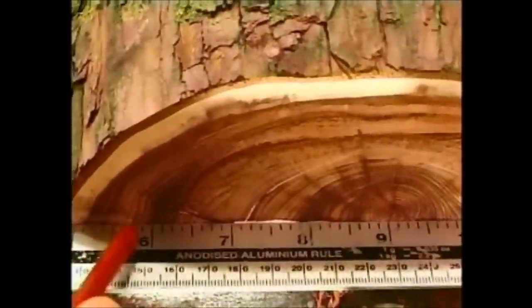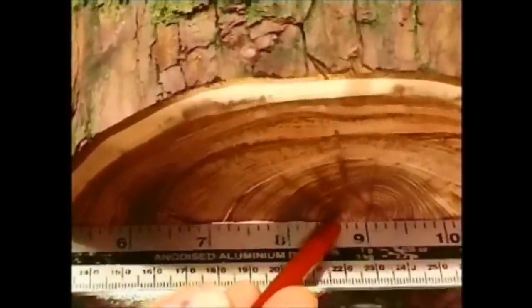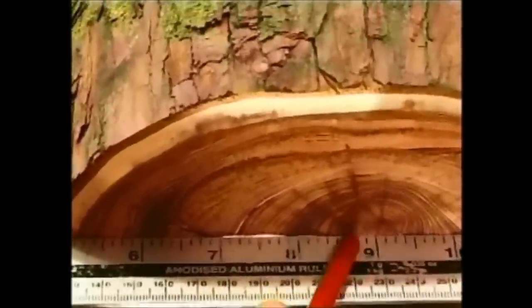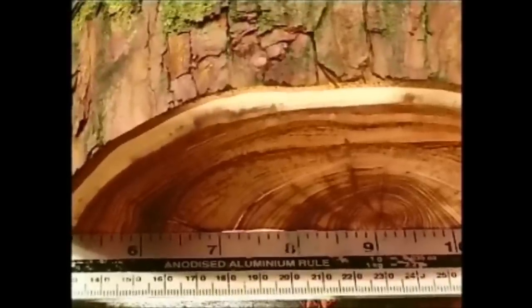Get this surface as flat as you can. Do not leave it bulgy, or the candlesticks will rock. Most people leave their bases concave to avoid the difficulty of cutting them flat. That will not work here. A hollowed base will leave the three sections tipping inwards. If you cannot get it truly flat, create two circles that both touch a ruler. The first circle wants to be inside the bark line, or it will not be a full circle, and will leave the candlestick slightly tippy.